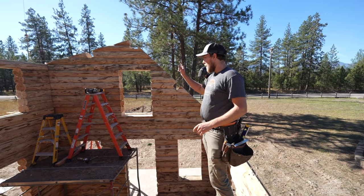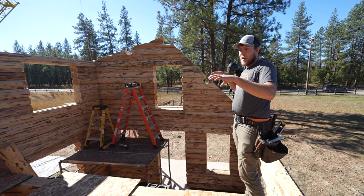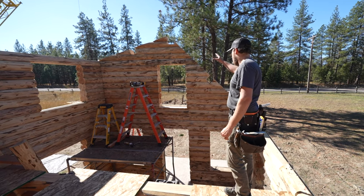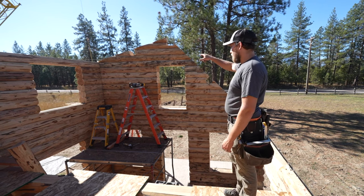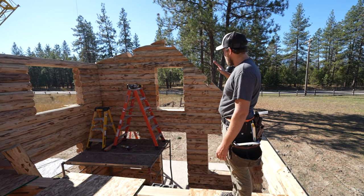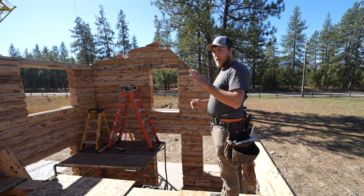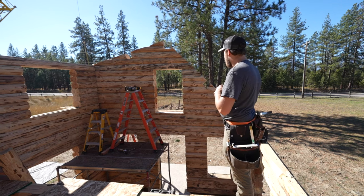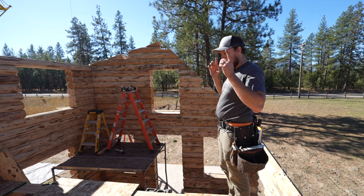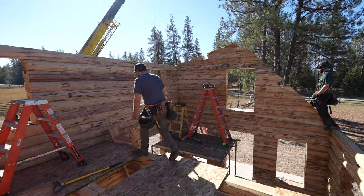Now when we go out there to our purlins, we've got to use those two numbers to orient this in the right way, to set this pitch right. This roof here is a 12-12 pitch, or whatever the case is. This top one is flatter, this one's steeper. We're going to have to hook our log with that pitch, so when we drop it in, it'll go in at the right pitch. Obviously, if it's not tilted right, it'll bind up in our square mortises. So 10 on this side, 9 on this side. We need to keep that in mind to help us orient the actual purlin the right way.